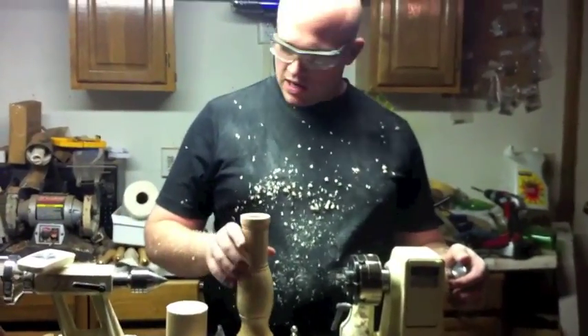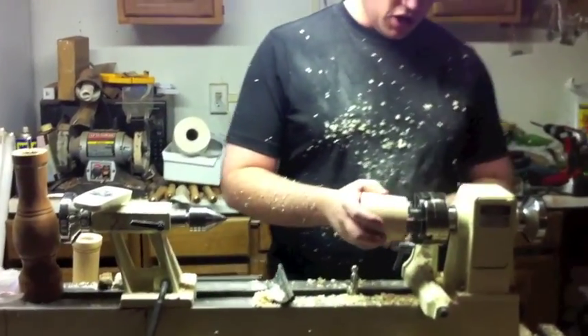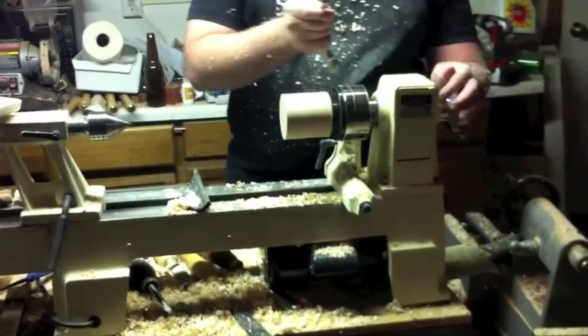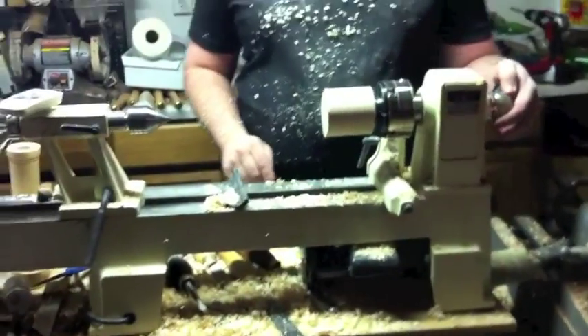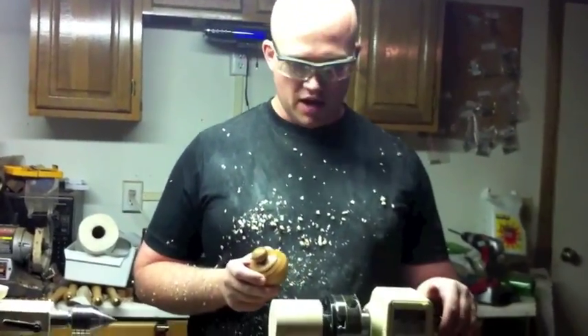We've got a completed body — it looks pretty good, pretty shapely. Now we've got to work on the head because that doesn't look quite right. I'm going to do the same thing I did earlier where I put that on to the chuck and open it up so that it stays in place. It should be pretty round. I'm going to rough that down a little bit, and then start to work to add some of those details. I'm going to do the details the same way — use the calipers on the widest parts and on the little bun at the top, and make those marks on the headpiece, and we'll soon have the top of the pepper mill.